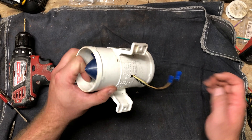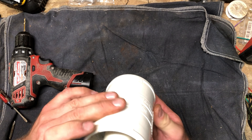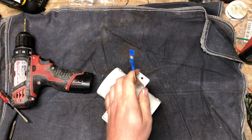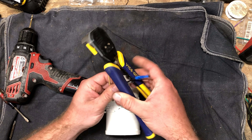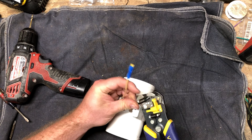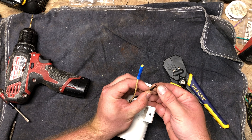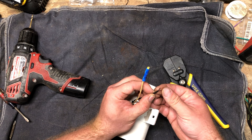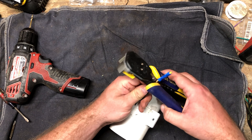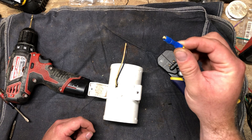This one was just making a lot of racket, so I figured I'd take it apart and see what's going on. The wiring going in here is not marine grade wire, which is interesting. You can see that the copper has a little bit of the black death to it — not quite green death yet. I'm amazed at how much stuff is hooked up with these crappy little crimp connectors. It's just going to let moisture get in there.